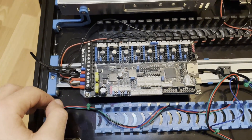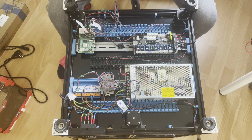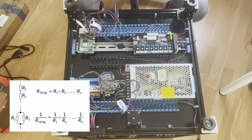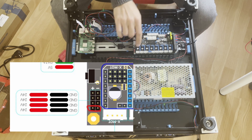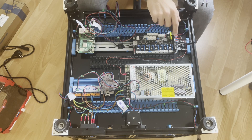Now I will test the board — is it working and do I get 24 volts? The Spider board recommends not putting the TMC drivers until the capacitor is discharged if the board was previously powered. We need 100k resistors. If you have 50k resistors you can put two in series for 100k, or if you have 200k you can put two in parallel to make 100k. We need to put the resistor between the positive and ground on both capacitor locations.